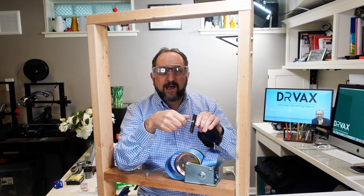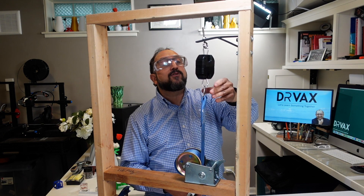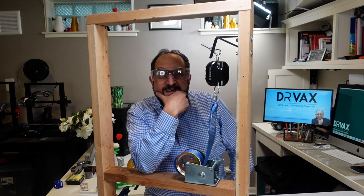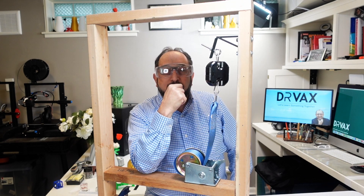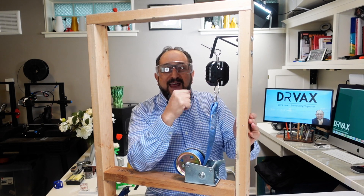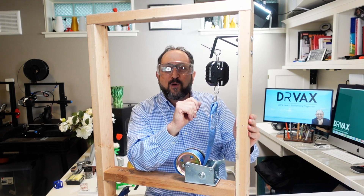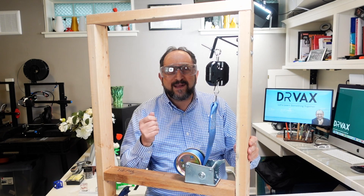So let's look at Tough PLA. We're at 5, 10, 11, 12, 15, 19, 20, 25, 31 — wow, interesting. This snapped quicker. It appears that Tough PLA bends less and snaps a little quicker. Clearly, the nature of your application is going to make a big difference. Let's see what happens with Tough PLA when it's annealed.